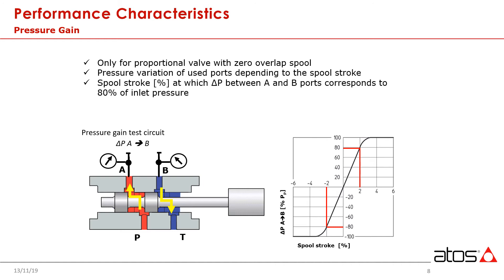With zero command reference and system pressure up, we gradually tweak this setting until the cylinder motion stops. Going back to our closed-loop position example, our servo spool will be in constant action, continuously modulating ever so slightly to maintain a differential pressure across A and B such that the net forces acting on the cylinder are equal and we hold a static position.